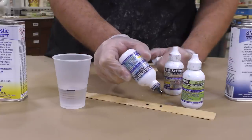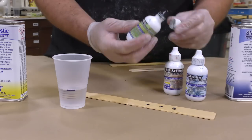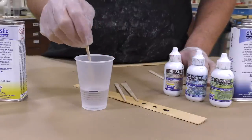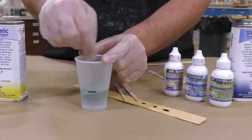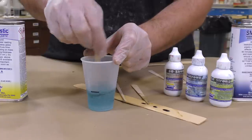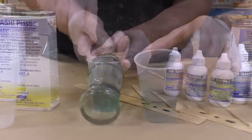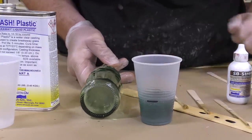Notice that I'm dispensing the pigments onto a palette knife separately — not directly into the resin — because we don't want to overpower the resin with pigment. Very small quantities of three pigments are added basically with a toothpick and mixed in to see what it will look like in the final casting. We're adding a little blue, a little green, and a little brown to achieve the glass-like color the original bottle had, then comparing it to the original model.